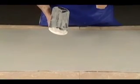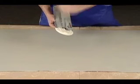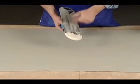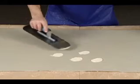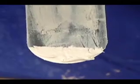Let's take a more detailed look at adding the second color into the finish. Here I have a trowel and I have a lighter color that's on the end. Now what I'm going to do is dab the surface with this lighter color, and I'm just going to do it in a very random way. So here I go. So I just keep tapping, dabbing on my color until I like the way my color is distributed on the surface. I started off with the tip of my trowel first to apply the material.